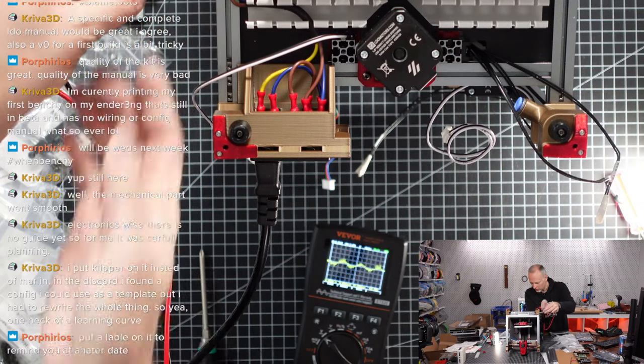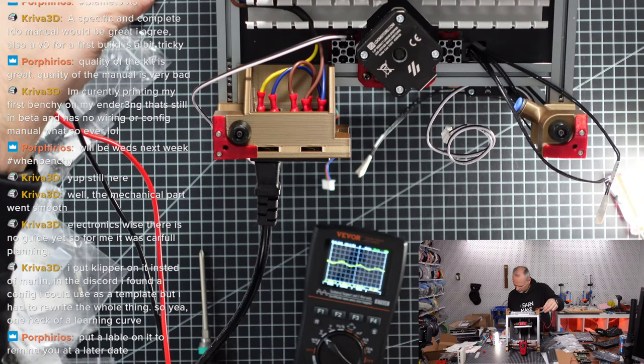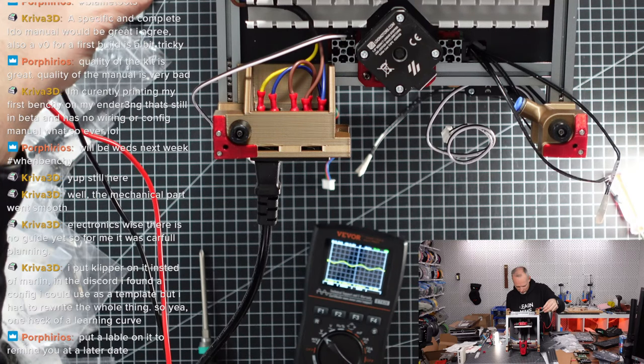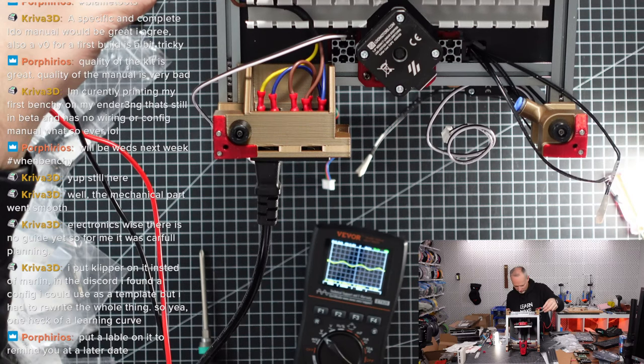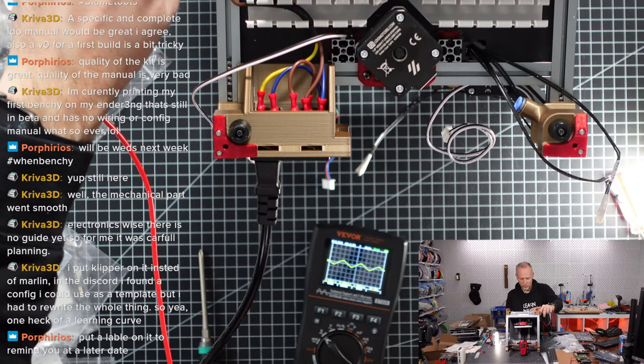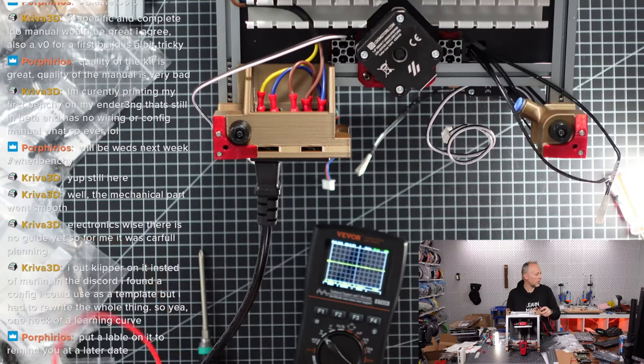Okay, that's the ground pin. Okay. So we got a little wave here, but for me, I have to understand how the range is and how much of a difference there is. Trigger level. I think I have to read the manual first, but does it make a difference which pin I use? Zero point ten volt average fluctuation. That's probably not much. 0.1 volt. Okay. Interesting.